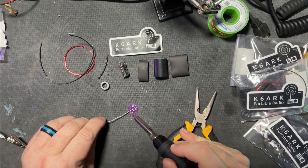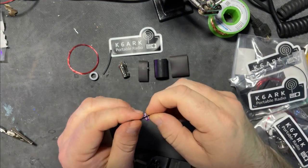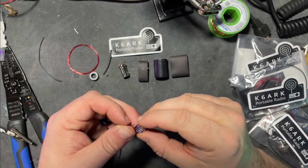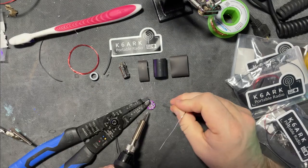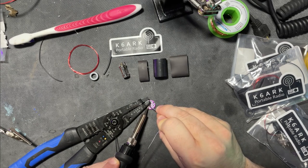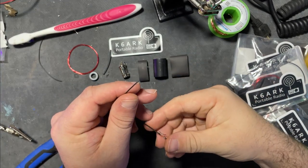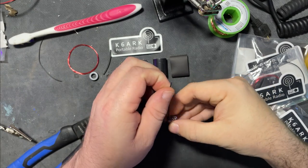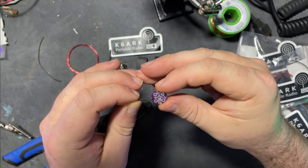Much on this side, so see if we can get it. So you want to fold the polystealth wire in half, and then you want one end being about an inch longer than the other. And where it says antenna, we're going to feed it through like that. Take the other end, stick it through the strain relief hole here, back up to the top. Resistor and antenna wire has been attached.